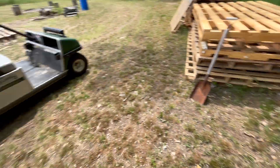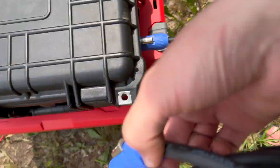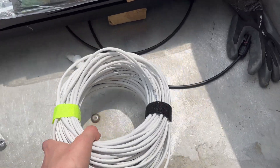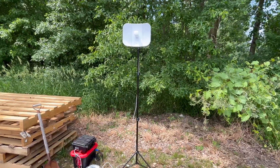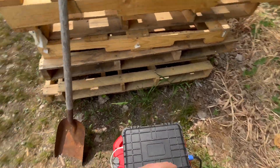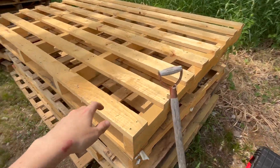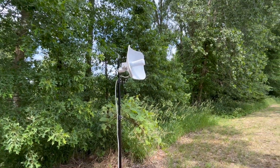It's going to go right in here and this will actually have a clear line of sight view to over there where it's going to be shooting. So we are over here now — we're just going to plug this in right there. Our box now has power from the battery and we're going to hook up the solar panels. Next I'm going to set up the stand and then we'll do the solar panels after that. We have our point-to-point antenna up. It is not in a specific spot yet — I'm still waiting until it boots and then I can do the antenna calibration. The ethernet cable is there, box is plugged in, everything is receiving power. Next step is I'm going to take some of these solar panels and literally just set them up here on these pallets that we have. This is obviously all temporary — I'm just trying to test it out, make sure it all works, and then we'll do the final install.